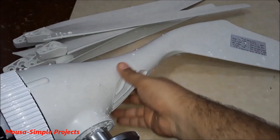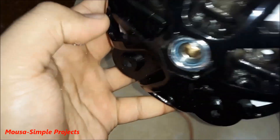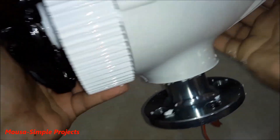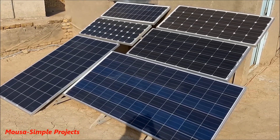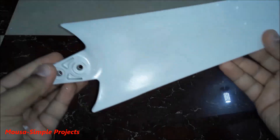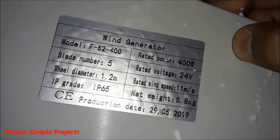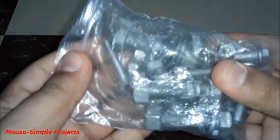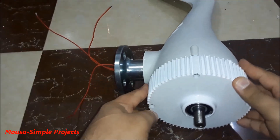In this video I want to make a review about this wind turbine. It is a Chinese 400-watt wind turbine I bought from China for about 250 bucks, and I used it for five months. I have a solar system in my house, but the wind turbine can be useful on cloudy days. This wind turbine comes with five blades; the blade size is 58 centimeters and the diameter is 1.2 meters. The flange, wind wheel, screws, Allen key, and even the controller were in the package.